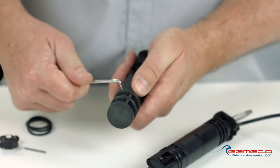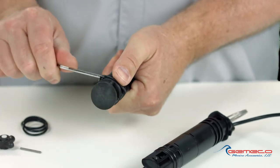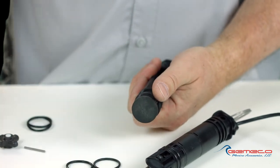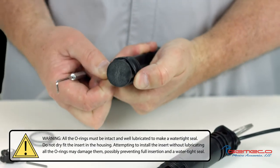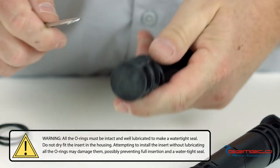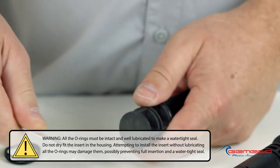Pulling the highest o-ring first, I'm going to insert my pick tool underneath there, work it out of its groove, roll it off, making sure that the new o-ring matches up. I will discard the old o-ring so there's no confusion. Install the new one. Repeat that one more time and we'll be ready to get back on the water.